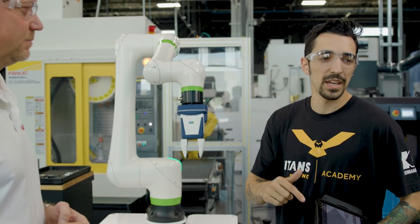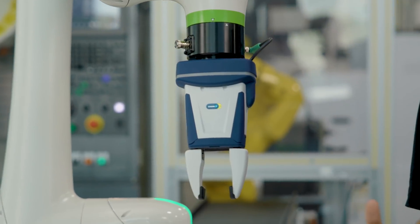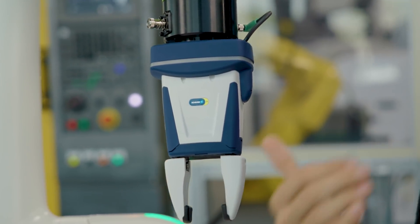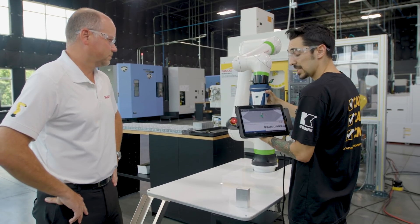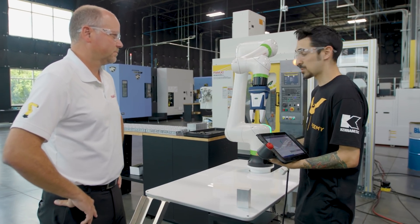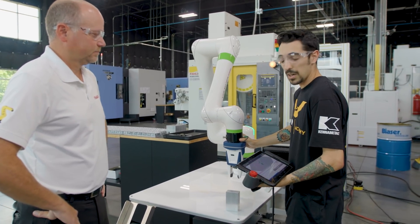It's time to show you guys how you can always upgrade your automation process, and that's what we're doing with the CRX. We have an EGP gripper from Schunk — it's a really nice collaborative gripper. That's what this ring around the outside symbolizes: you'll have green lights and red lights to let you know when the collaborative state is safe. We're going to click a button on the back of our pendant, and this puts us into a free jog state, which is really cool with the CRX because I can move it however I want — and that's not something you'll see on all robots.